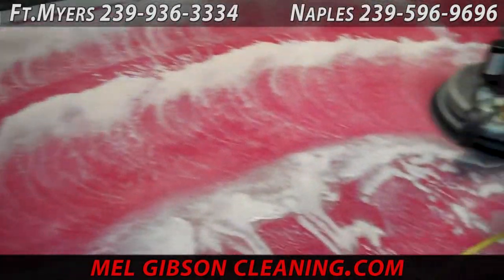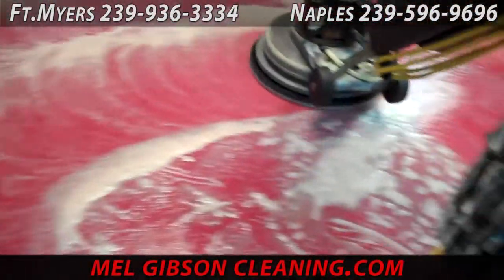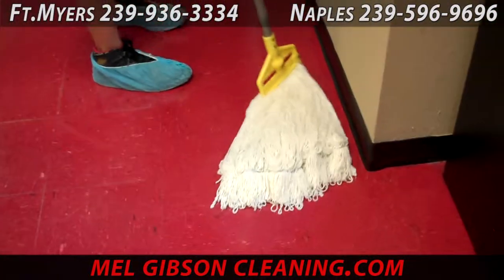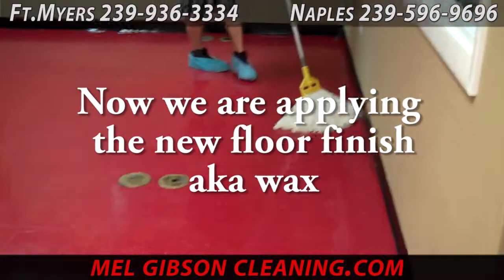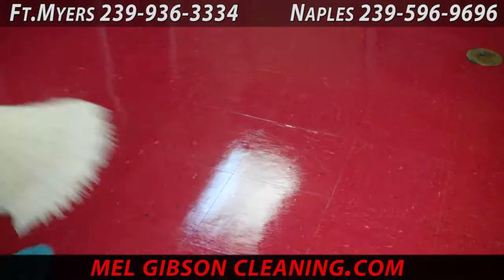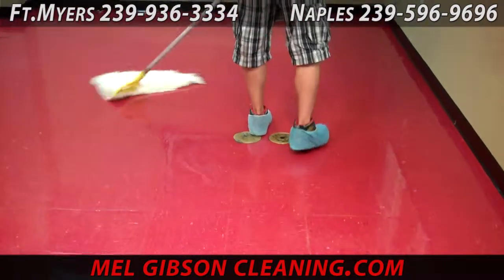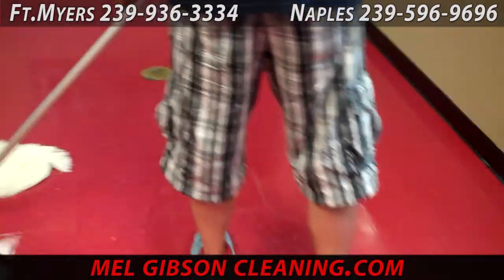Once we finish with the stripping machine and all the dirt and soil has been loosened up, we wet vac all of this solution off the floor and then triple rinse it with a fresh mop, fresh bucket, and fresh mop head. Once the floor has been completely cleaned and neutralized and we've confirmed there's no residual dirt or wax left, we come in and start reapplying the fresh new floor finish. A proper strip and refinish job involves five, or preferably eight to twelve, coats of floor finish. The first coat or two basically fills in the pores of the tile, and then you start to build layers of protection on top of the floor. As you can see, this floor is coming back nicely already — even the severely beaten up areas will start to even out in color once the floor finish goes on.